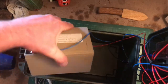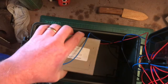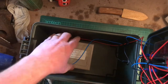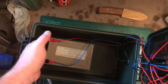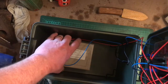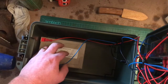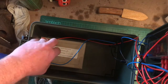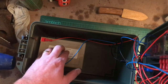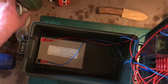I've got a 12 amp battery, which is pretty much the biggest one they're selling on eBay for these power packs - the dearer end. This is a mobility scooter battery, a good battery. They're only about 22 quid. You could probably get a couple and run them in parallel, but for now 12 amps is doing well. And because I'm charging it directly from the outboard, it's always getting topped up anyway.